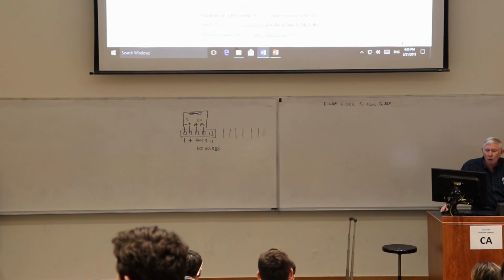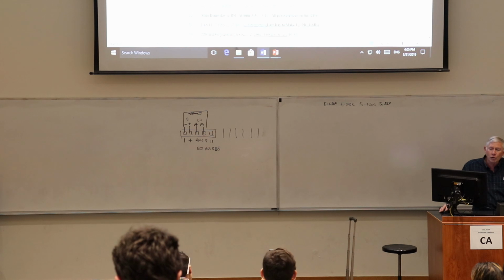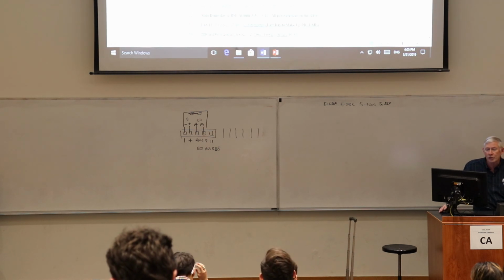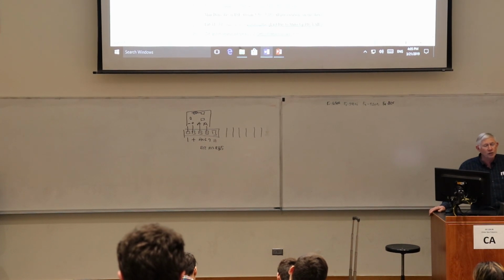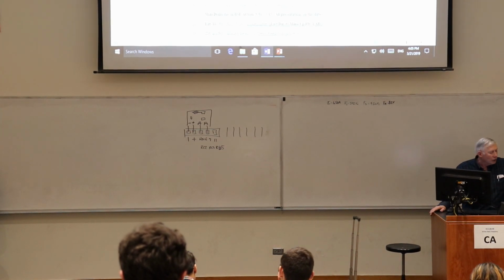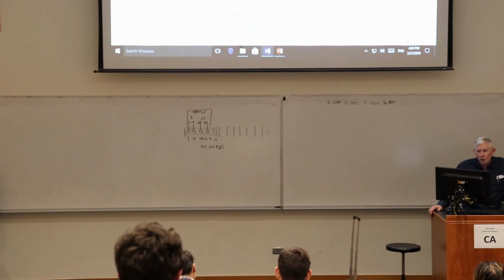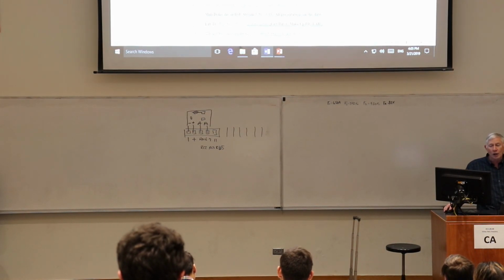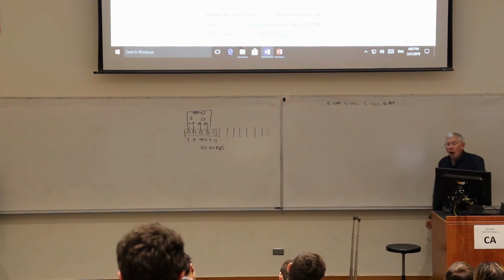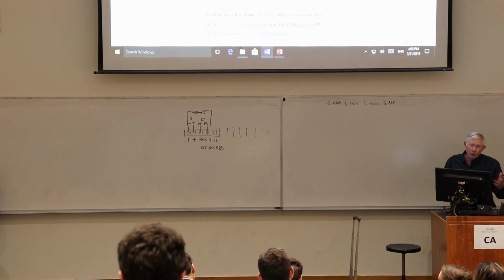Okay, so that's what we'll do in lab, and basically you'll need to use the analog to digital converter to sample these two channels, one for the LM35 and one for the photoresistor, and then you'll also need to display that information through the UART connection using the CP2102 and UART to TTL connector, or TTL UART to USB connector. So once you do that, you can open up a terminal program and you should display the temperature and the photoresistor reading.